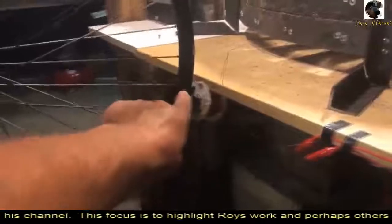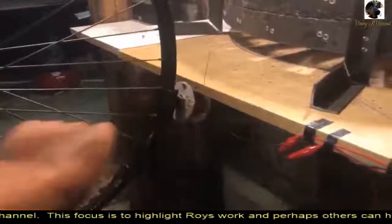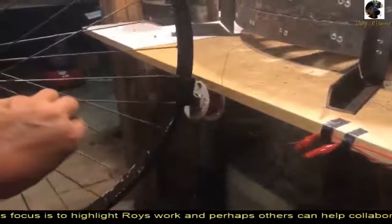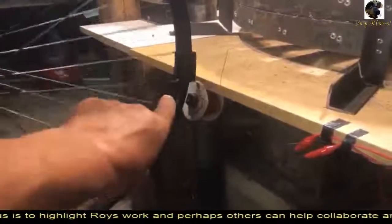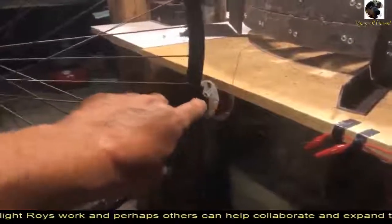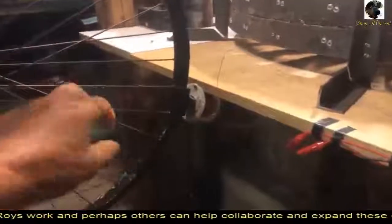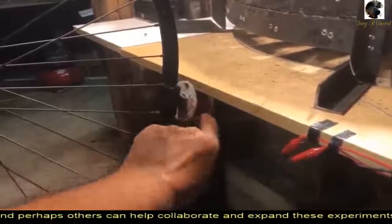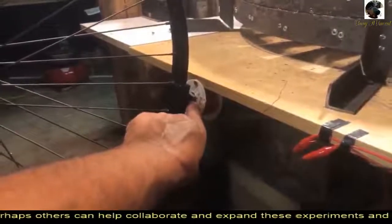So if you were to take, without thinking this through, you would put a neodymium here, still have the iron core here, you'd have 10 times the field here, such a strong induction that you would saturate the iron as well, and you would have to be able to break that, because what you're doing is creating a resistance or some stress in the system. So what would you do to overcome that? You would either back this up or go down in size of the iron core.